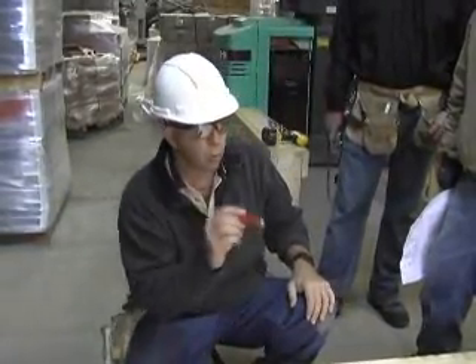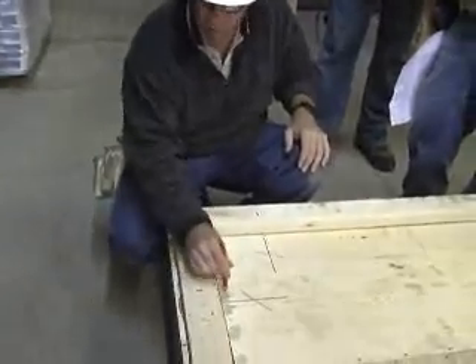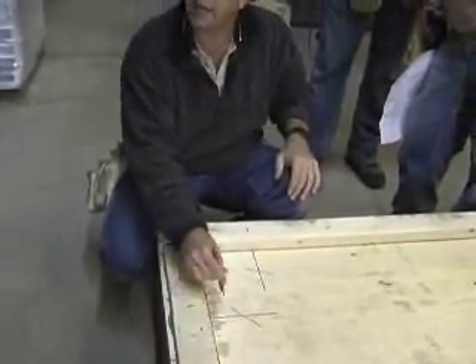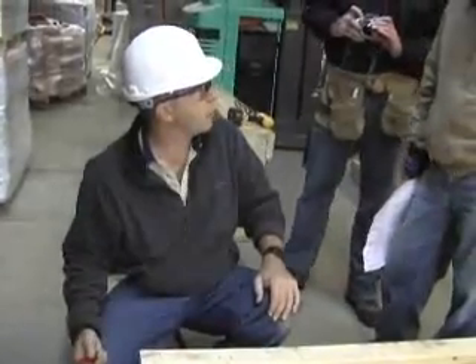So at this point we're going to go ahead and drill through with a ship auger bit all the way through our plate, down through our sheathing, and into either the basement or the crawl space where the electrician has the ability to push that wire right up to the body of the panel.